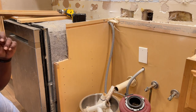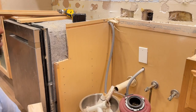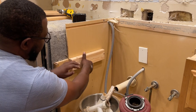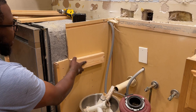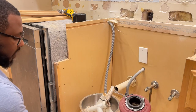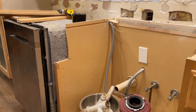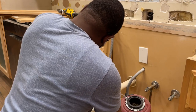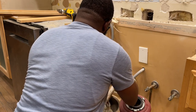I am not going to trust the weight of a full sink of water off just a couple of anchors on the side of this press board — that's not going to do it. So what I'm going to do is mount the 2x4 where it needs to go, then come underneath it with a couple of braces and screw those in too. That way I can make sure it's really solid under there and the sink won't fall from too much weight and not enough support. The thickness of a 2x4 is an inch and a half, and the side is a half inch, so I'm going to use 2-inch screws.